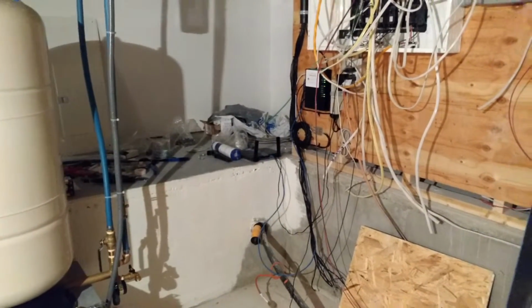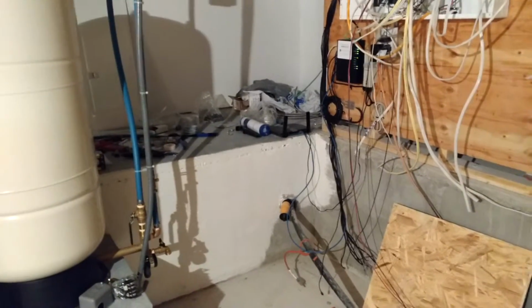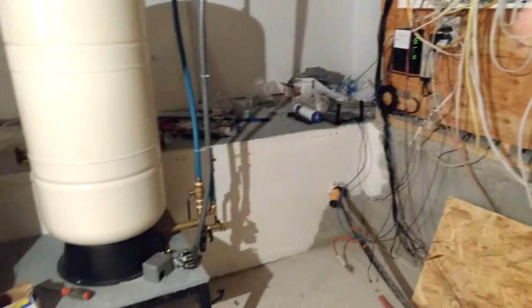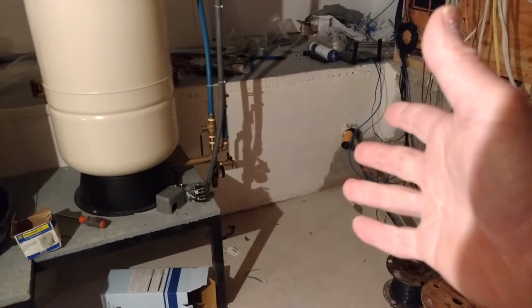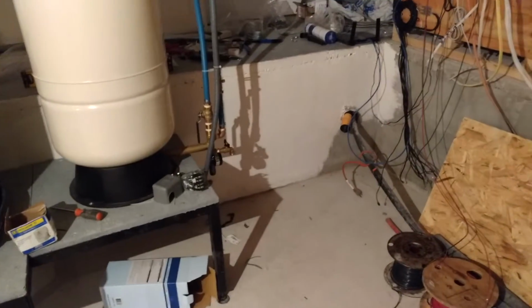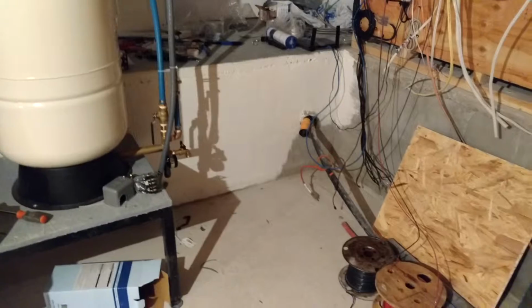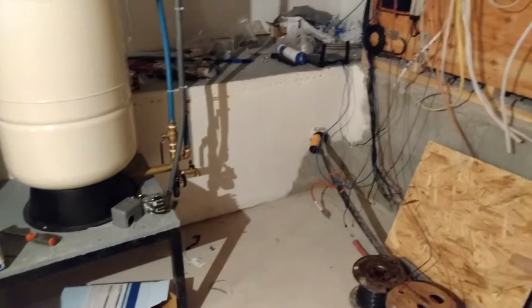If there's any sediment that wants to collect in the bottom of the well, that could get stirred up and then get pulled up into your water system. So I was looking at a 3/4 horse jet pump. I was looking at between $460 and $500 anyway, with a good foot valve in the well. I wouldn't have that problem of stirring it up.